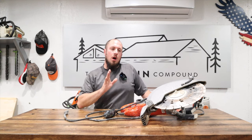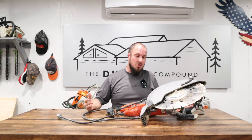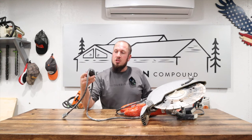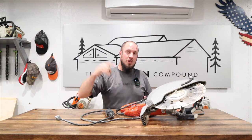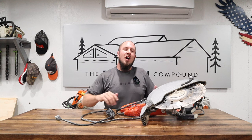We were sawing with it vertically, holding the saw. From minute one, it was popping a 20-amp circuit breaker — a dedicated circuit to this saw. This saw says 15 amps, so from the very first five minutes, I popped a 20-amp breaker dedicated to it. I'm already frustrated because I'm showing up for a hired job. I told someone to just stand by the circuit breaker panel and keep flipping it back on. But once you heat the breaker up, it just keeps popping back and back and back.